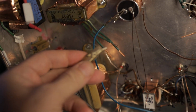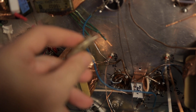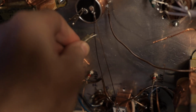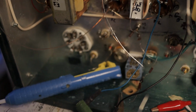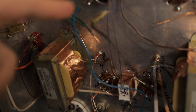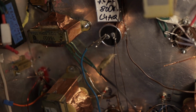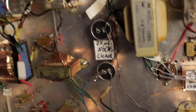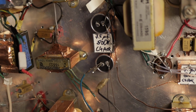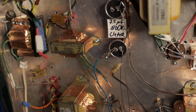And what you do, you see there's insulation. You see there? Now you see it. So there's insulation around the clip, and then you can just stick it to the positive, and then it will bleed. What will happen is that it will drain the capacitor. And that's what a bleeder is. It drains the capacitor of its voltage, and then it will be safe to work on.